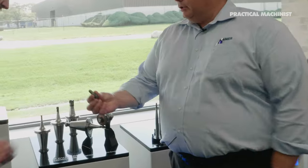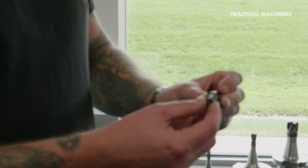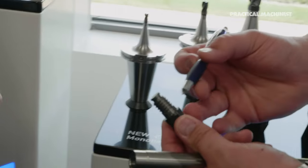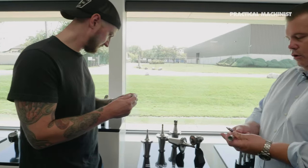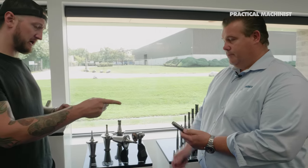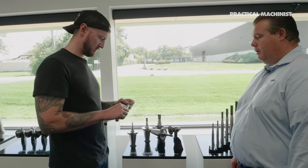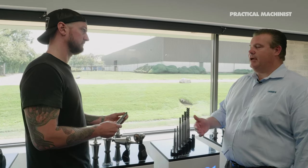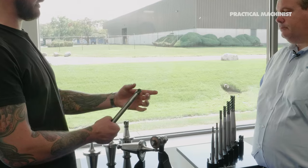These are the Dual Lock extensions — the strongest solid carbide indexable end mill system in the world. The entire extension is carbide right down to the threads. You see a load-bearing thread, then a pilot, then two angles — a very strong connection between the cutting tool and either the monoblock holder, the dual lock extension, or a carbide core dual lock extension. That carbide core extension has real heft to it — the design is to dampen vibration. Our four-flute Haimer Mill dual lock end mills can take a 1× to 1.5× D full slot in steel, for example 4140.